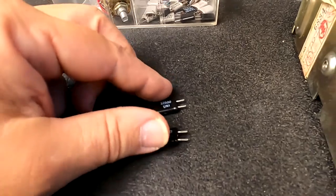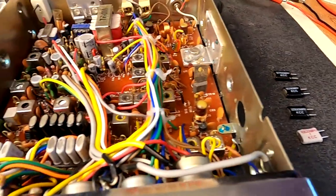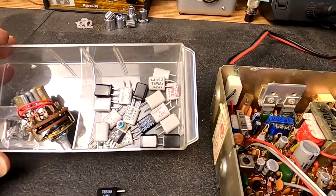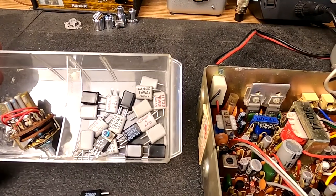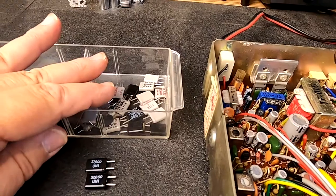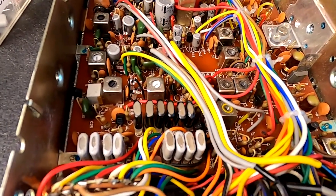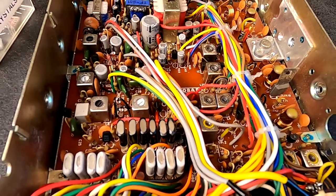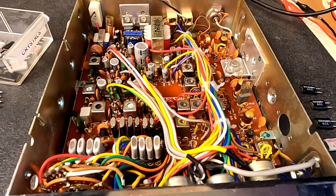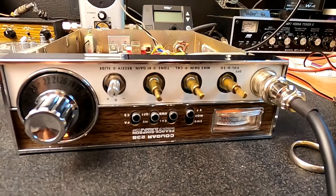So it's definitely worth it. If you're just getting into CB radio, if you're new to this, you find old radios and you're going to pull them out for parts — don't forget to pull out the mixer crystals someday. If you're trying to repair an older radio, or something happens to the one you're using, you've got the parts to take care of that. So I hope this helps. Please leave questions or comments down below. Thanks for watching. Cheers.